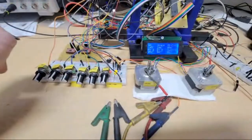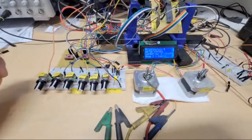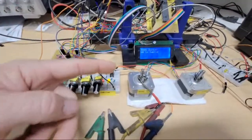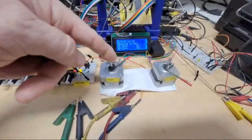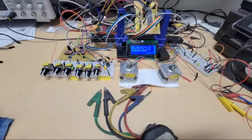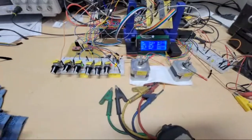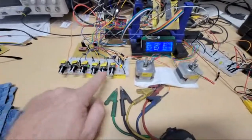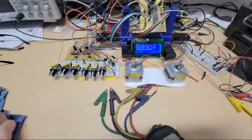Reading thermistors. 106 in the space. Turn that a little far. So now it's going to be a mode switch, water heater to hybrid. Now it's going back to hybrid. It's switching expansion valves, going to the indoor one. Compressor's still running. I think switching that fast, it ain't gonna screw anything up. We'll see. And so you've got the indoor fan on, the compressor on, and the pump for the water heater on.